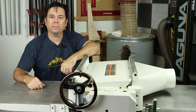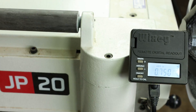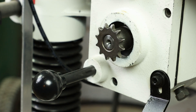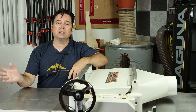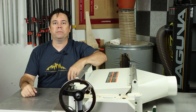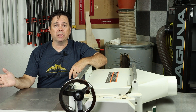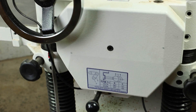Stick around, we'll show you how. Welcome to Sprockets, I'm your host Dieter. A quick warning: if you're using a planer with a two-speed gearbox, only adjust the gearbox when the machine is running. It may be counterintuitive if you're new to large machines, but it's true of even some benchtop planers with two-speed gearboxes — you only adjust the gearbox when the machine is running.